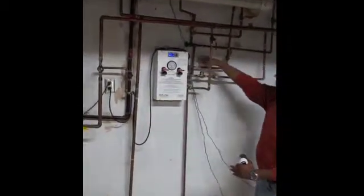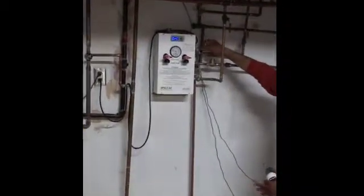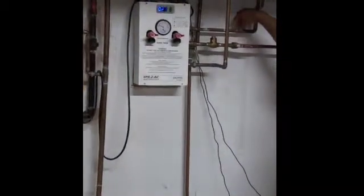These two ports on the pump station are the ones that circulate our heated antifreeze fluid coming back from the solar collector on the roof. And these two ports exchange heat from that heated fluid back into the tank.